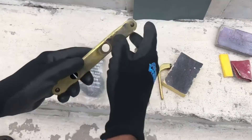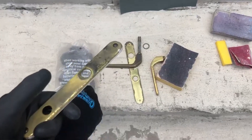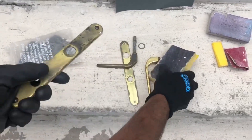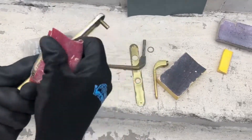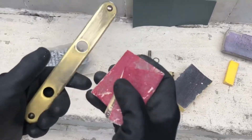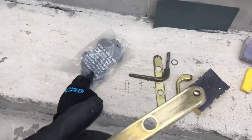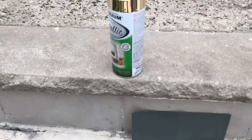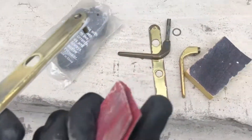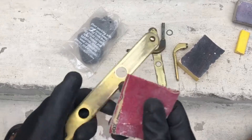Once that is done, I am going to wash the entire hardware and then sand it again using 2000-grade sandpaper, which is for the fine polish. Once everything is done, we are going to spray this entire hardware using the Rustoleum metallic sprayer. So first step — just clean it. As you can see I have already cleaned this one, but there is still rust and old paint, so I am going to start with the heavy sandpaper first to remove whatever is there.